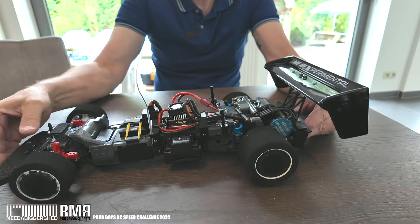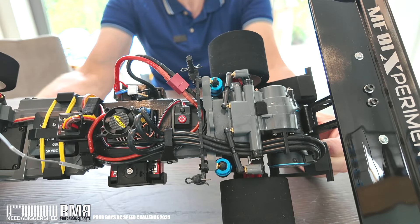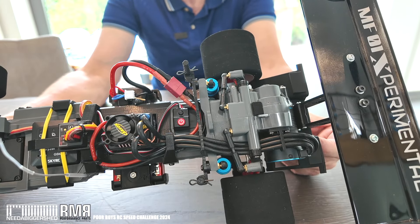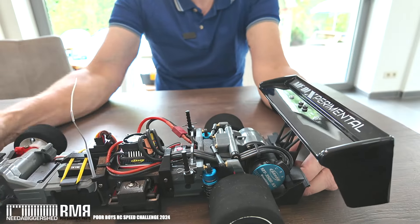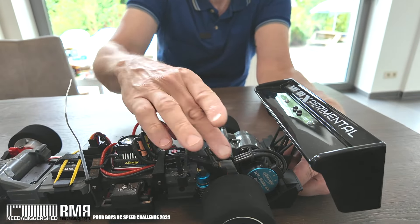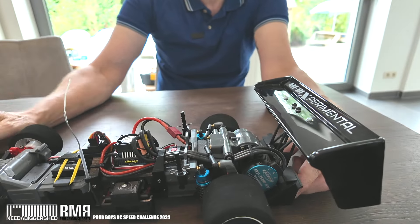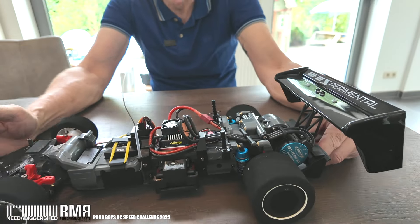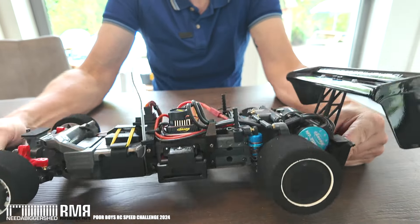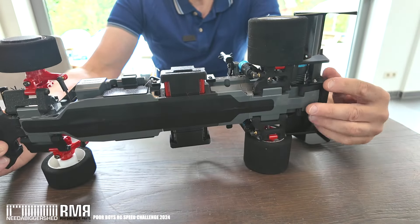I made a new spring support which also keeps the cables tidy. Body posts use the same holes as the body shell, so I didn't have to drill any new body holes. The only thing I had to do was modify the shell by cutting out the turrets — I couldn't lower them anymore because that would change the whole suspension geometry, and I didn't want that. Moving along, there's another bit of cable management and a printed clamp to hold the motor wires down, which also helps secure the speed controller.